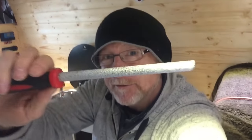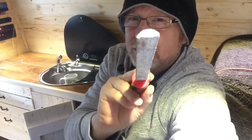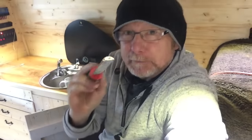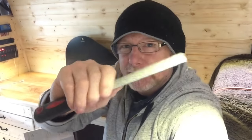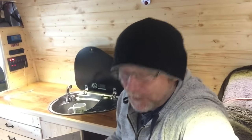This file, incidentally, is not actually a wood file — it's meant for ceramic tiles, a ceramic tile file. As you can see, it's diamond-coated, quite expensive, but unlike a wood file it doesn't clog up. I think it's diamond coating. They're quite dear but I've had this about 10 years and it's not even showing any signs of wear.